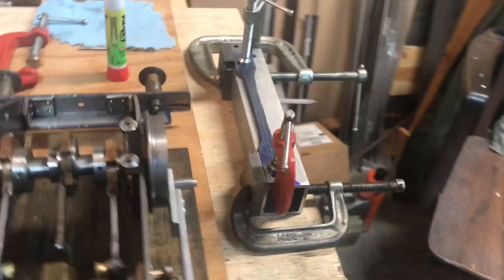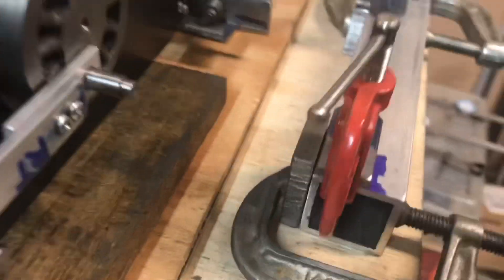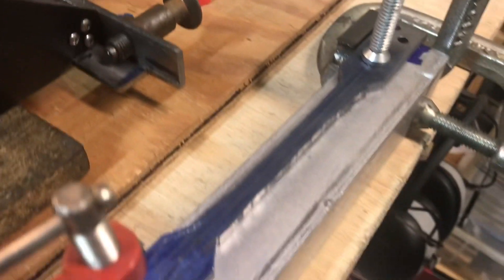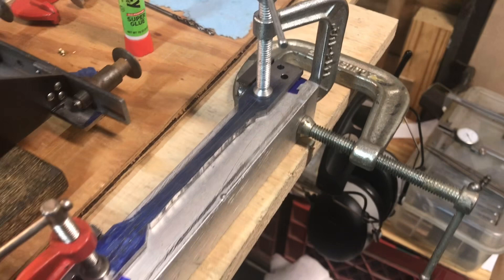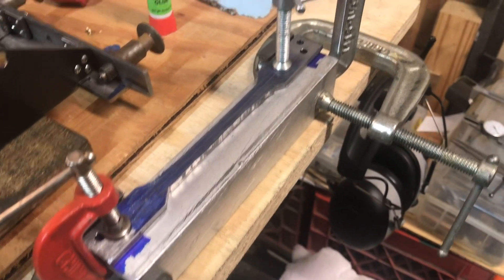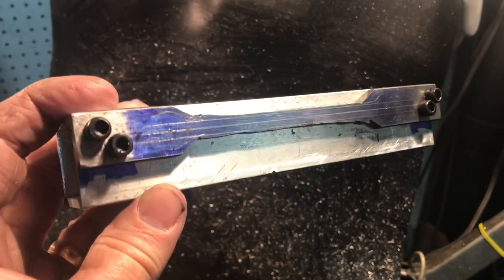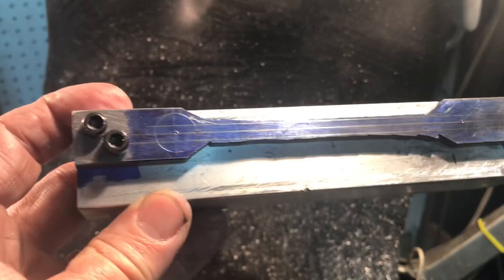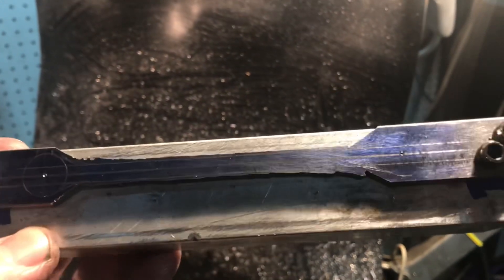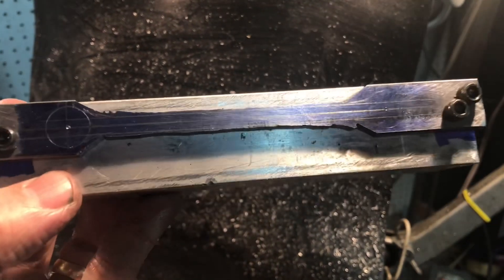Now to mount it to the block. Here I've got the rod blank after sawing — I've got it glued down to my square aluminum block. I used some cold rolled steel backstops, clamped them in place first, cleaned everything off real good, and applied the crazy glue to the back side of the rod blank. I've had it clamped down for a few minutes, so I can move it to the mill. The plan is to drill and tap some 10-24 holes in the aluminum, and I've got some nuts to put on them for additional holding strength for the milling operations.